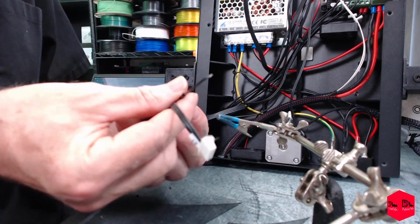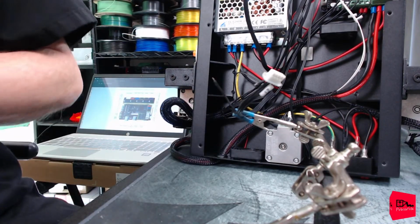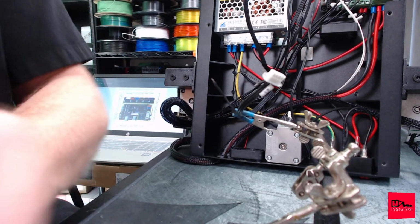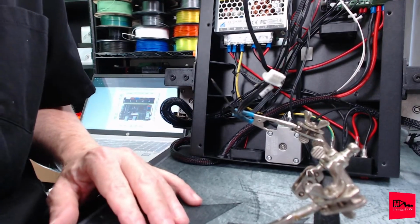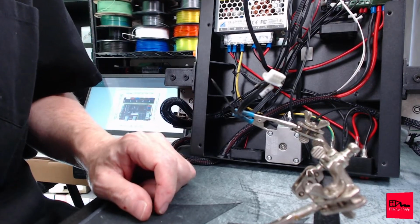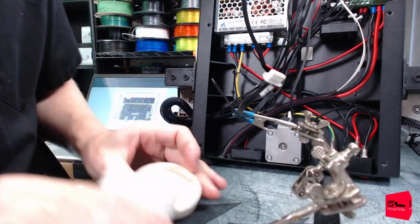And you're probably wondering, why don't we just do that? Since, you know, the wire's stripped, it's easy. I bought the cheap crimpers. I'll tell you right now, if there's anything you're going to spend money on in this hobby, it's decent crimpers. It was a big mistake. I know it's very difficult when you first get into this. Also, with some of the listings on Amazon, you're like, what is that? Are they DuPont? Are they JST? They're so close, and they all can interact together. But yeah, the cheap ones were a bad decision. But this should be fine. It'll be fine.